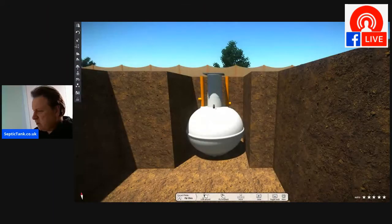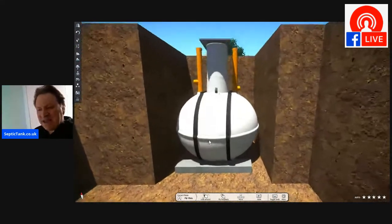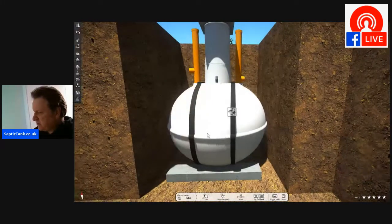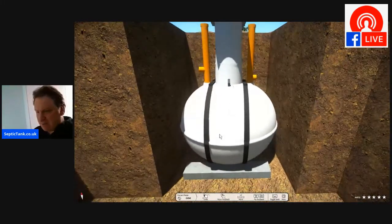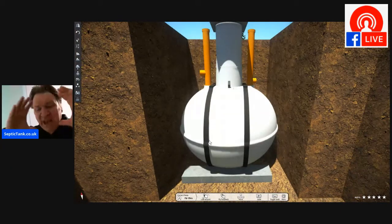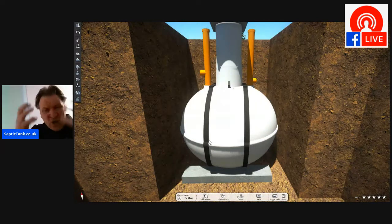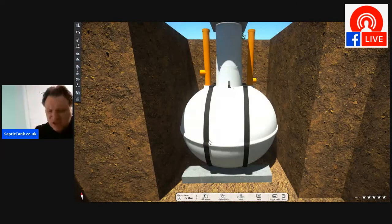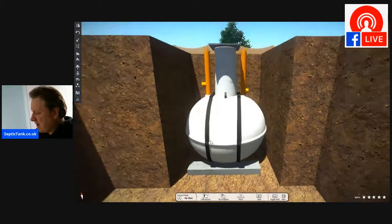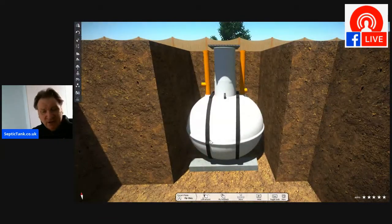So this is what we call an anchor system. So you've got two straps. Can you see the straps there? The straps are connected to like a big lintel. And the lintel, very heavy lintel, holds the tank down. So if there's any water pressure pushing up, trying to push that tank out the ground, the straps and the concrete lintel there will stop it from popping out of the ground.